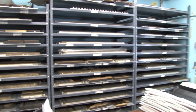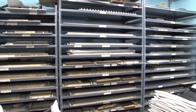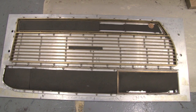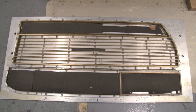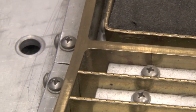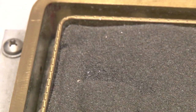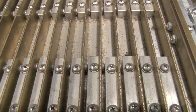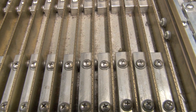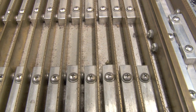We estimate that the tooling on these three shelves would be about half a million dollars to replace. This is the tooling for doing just the front door on a 1965. In certain places they have to be machined so that we have the corner effects. The thinner rule can be bent. This is a close-up of the brass rule — it's about an eighth of an inch wide with a fake stitch engraved in reverse on the brass.